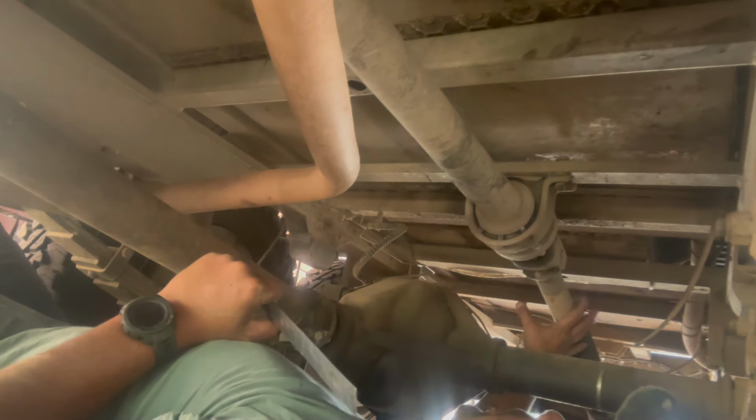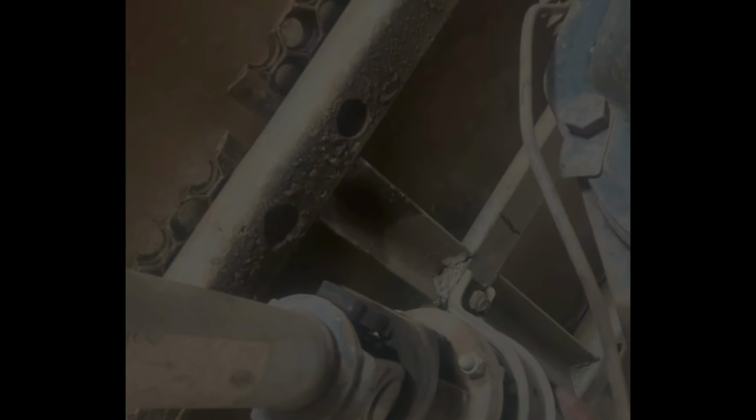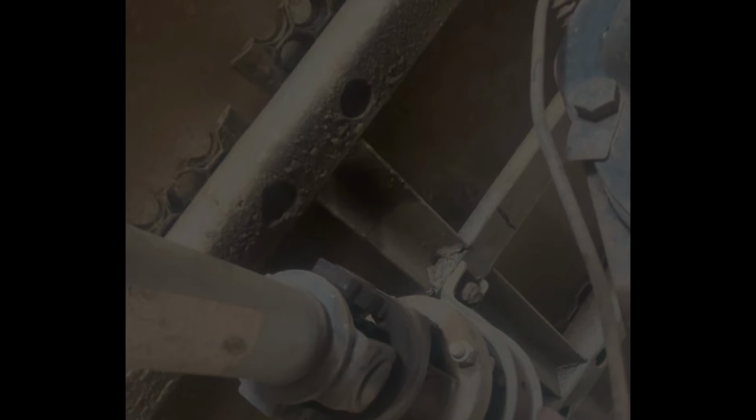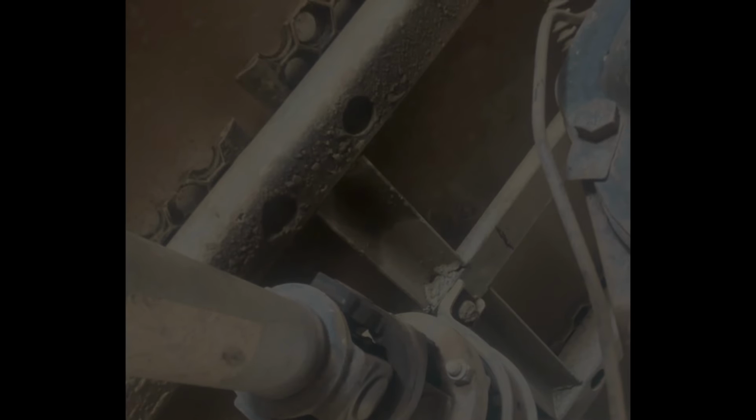And then obviously the prop shaft on the rear, that's telescopic, so it shouldn't really affect that at all. And if anything, I'll bring that whole thing down 10 mil. I don't think that's gonna affect the angle of the prop shaft too much, but it will certainly make the mount for the center bearing here sit more neutral, and I can't see why it shouldn't work. So pretty new to welding, but let's give this a go.